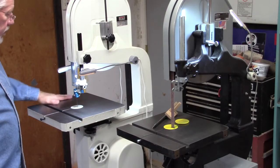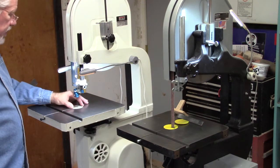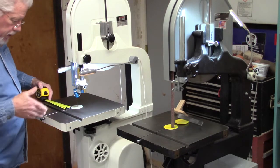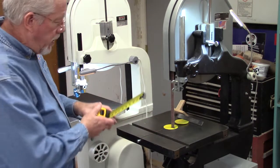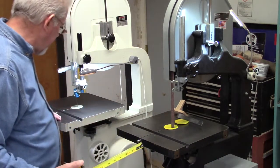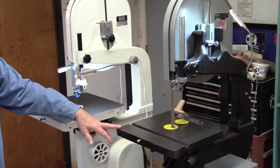This is a 15 by 15-inch table and the old Delta is a 14 by 14-inch table. They call this an offset — what that means is on the front of this bandsaw, from the center line I have 8 inches, and on the back side I have 7 inches. On the old Delta I have 6.5 inches from the center on the front and 7.5 inches on the back. So the Jet gives me a little more front to set things up and I only lose a half inch off the back.